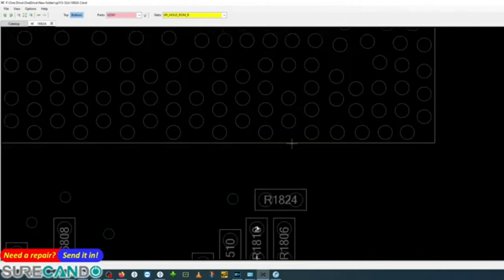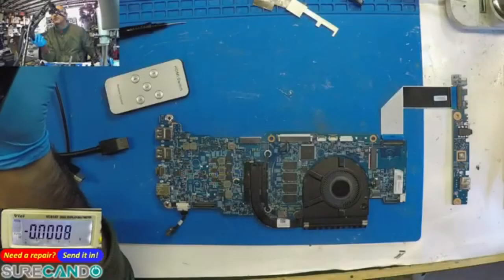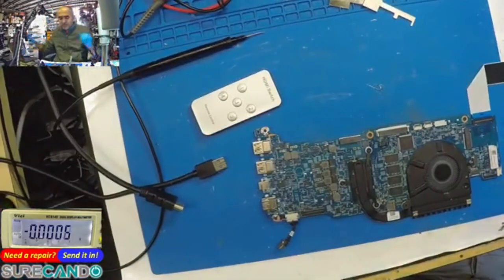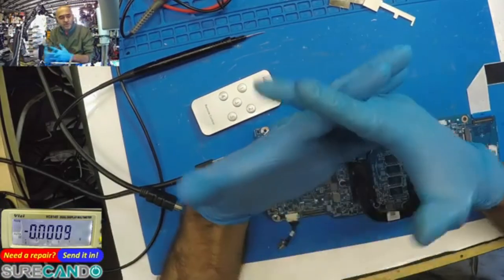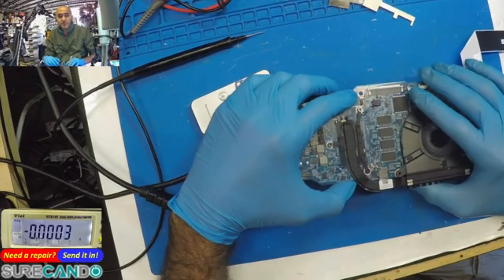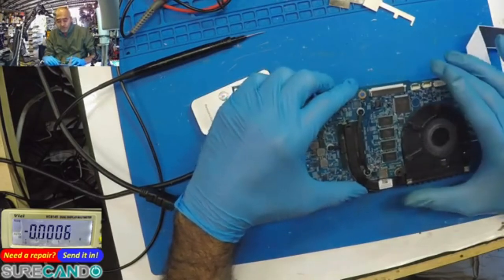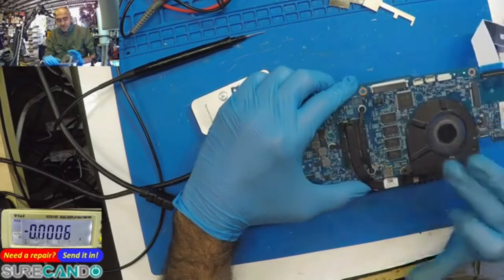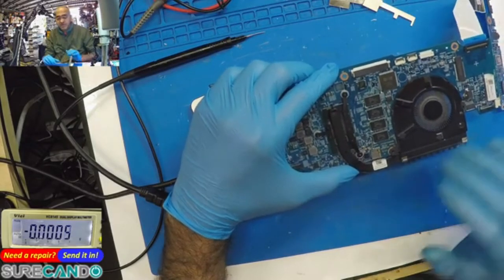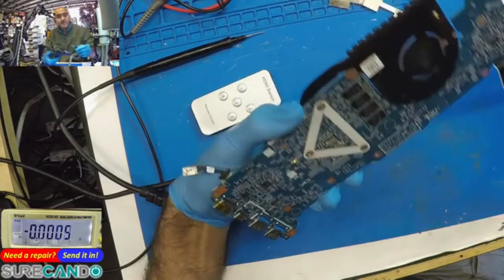So in a way, I was right focusing on the BIOS chip originally in the beginning, because there was no communication happening. So I thought it's a BIOS chip. And then after that, I focused on the Super I/O. I flashed the Super I/O as well, using RT809F. There's a video on that too. And that didn't work. The only thing I could think of was the onboard RAM, reflowing each one with the heat gun until it moves a little bit, and that didn't make any difference either.